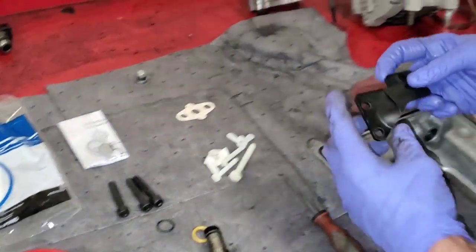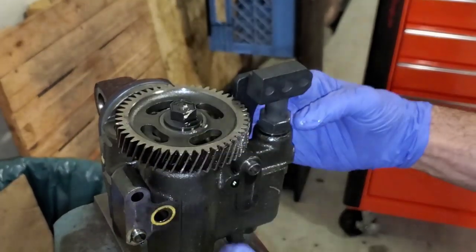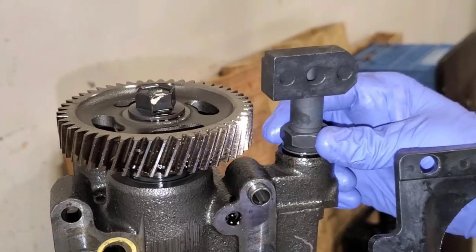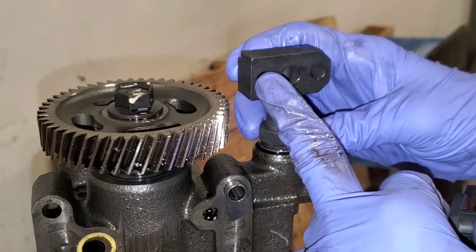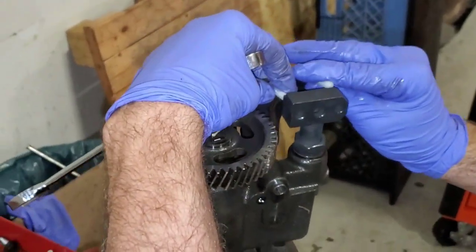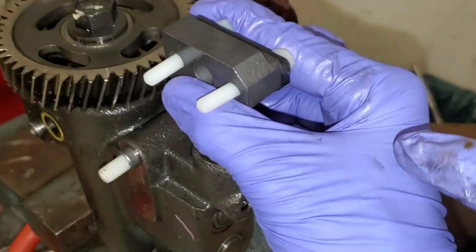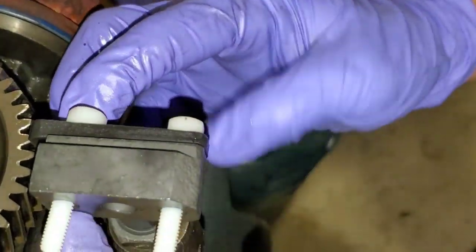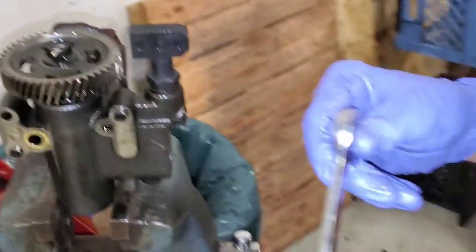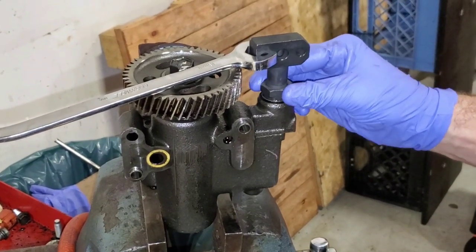One thing I wanted to show you is they want you to install this plastic bracket in one of the pump body mounting holes and through the adapter. I have broken this before with trying to achieve the proper torque on here, so I'm going to show you guys what I've done to keep this nice and sturdy. I'm just going to loosely install this onto the pump. They want you to wing nut this down. You guys can see how flush I am right here against the bracket — there's plastic pieces, you don't see any gap. This is going to be orientated so that it's nice and straight. Now that I've gotten it clocked where I want it, you can use a three-quarter or a 19mm, and I'm actually going to hold the block right here while I tighten this nut.